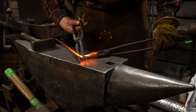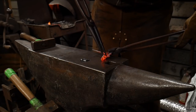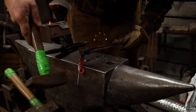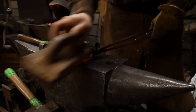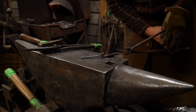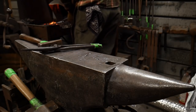Now comes the fun part — we're wanting to turn this thing into a pendant. You can do this a lot of different ways: you can work it over the horn of the anvil, or you can use a pair of scrolling tongs. My favorite way is using scrolling tongs and preferably a torch. We're going to create a first bend there, hammer that back down on itself, work the piece. Scrolling tongs and a torch really make this a dream to do. If all you've got is your anvil, you can most certainly do it there. There's the first little pigtail on it, and we'll just heat this up again. If you lock the leaf in a vise and use a torch, you can have a lot of control over how this turns out. So we're going to heat this up one more time and keep scrolling this up.